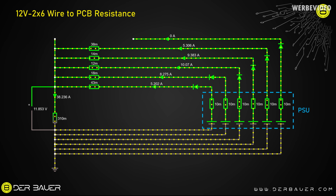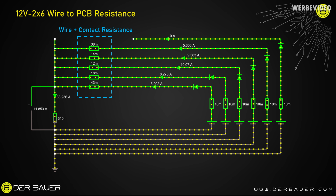So on the right side we have the PSU and on the left side we have the GPU. There we see 12 volt and 38 amps, which equals 450 watts, and that should be what an RTX 5090 is doing max under load. On top you can see the different resistances that I measured with pin 1 to pin 5 according to the table that I just showed you. Pin 6 is currently not connected in this case because I couldn't measure a resistance, but this is obviously not the situation when the connector burned, because we know there had to be a current flowing, otherwise it wouldn't have burned.